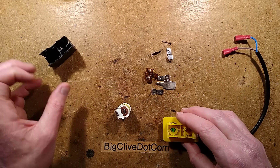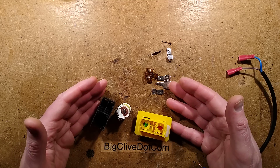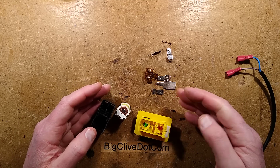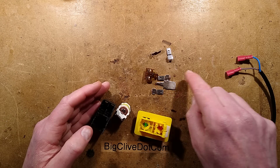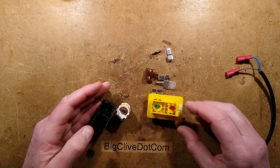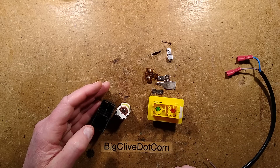Very, very common in electrical equipment. In the case of three-phase equipment you may find this is done with a contactor and an auxiliary contact. So when you push the button it brings a contactor in, but the contactor then powers itself. The stop button in that instance usually does just break the control circuit to that and let the contactor drop out. But that is it - a basic, simple no-volt relay.